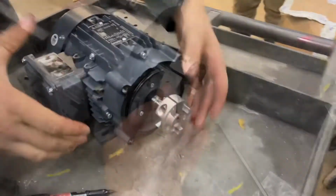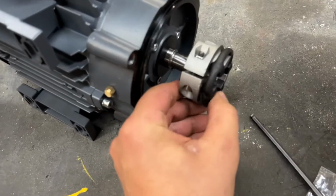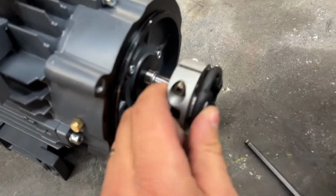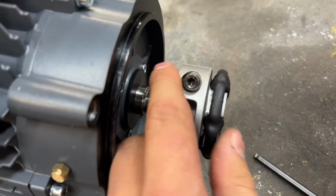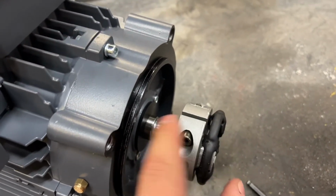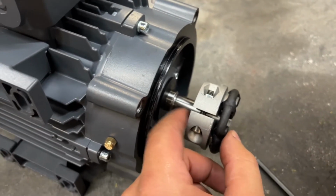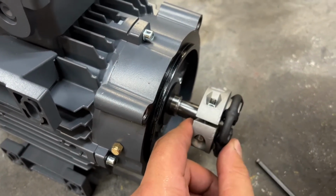Pop this off. So from our line, we're going to go back 1/8 of an inch, and that'll help any clearance that you can see. The black bushing is a little bit further ahead than the aluminum, so it'll take up all of that, as well as give us maybe a 1/16 of an inch worth of clearance for thermal expansion.